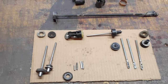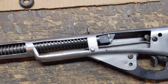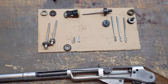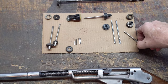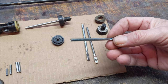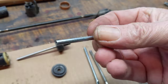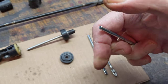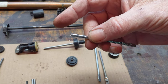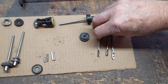My name is Bruce with Resto-Ma Daisy, and today we've got an in-depth video. I really don't know what I'm going to tell you about these things aside from trying to share the experiments I've been running for the last couple of days. The topic today is air tubes. An air tube is a critical part of the Daisy — it gathers air from the compressed cylinder compression chamber, guides it through this tiny little hole here and then up the spout.